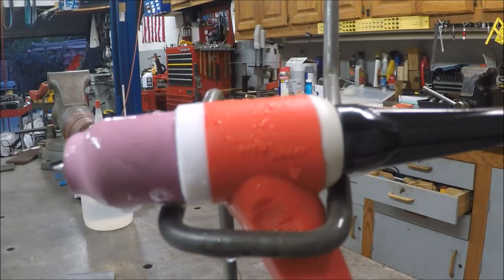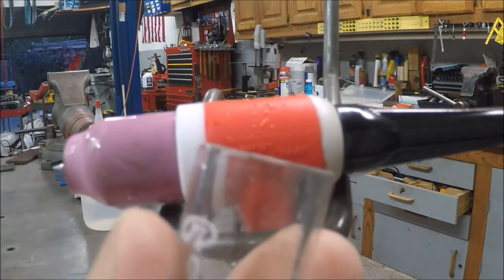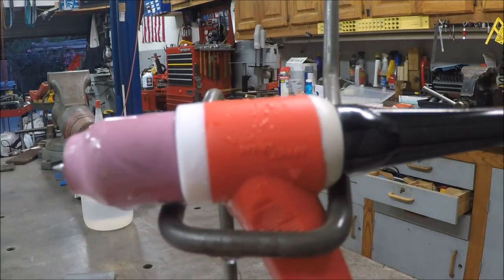Hence that's why this cup works — the pink cups work but the Pyrex cup doesn't work. I think I'm done blowing enough argon through this to realize that the Pyrex cups and how they seal with the o-ring is just not working, no matter how much gas you want to blow through there.